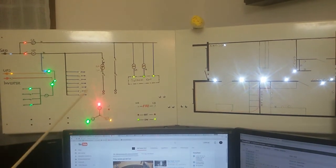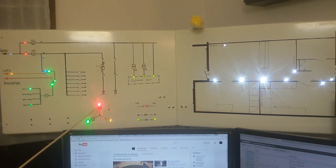So I'm going to go to the consumer unit and remove L1 and see what happens. This red light here is actually a red LED, it will turn on, and this bottom one, which is orange, those two will turn on to indicate that the main phase is gone. L1 is the main phase, which is actually the maneuver phase for the contactors. If that disappears, no contactor will work. That means that everything will shut down. But L2 and L3 are still available, but L1 is the main phase. So I'm going to remove that and see what happens.